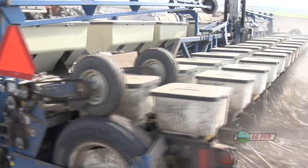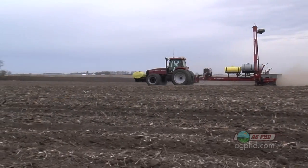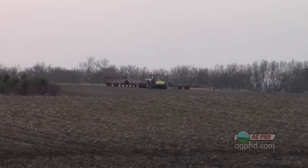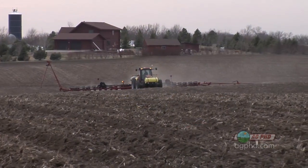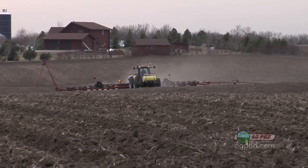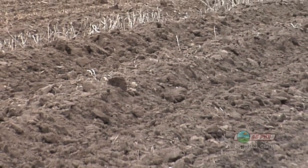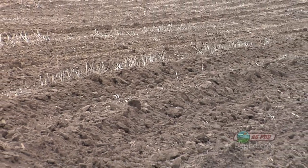Why is that our range? On the deep side, if you start getting deeper than two and a half inches, it's pretty cool when corn is being planted in the United States. We're out there fairly early in the spring, and when you've got seed that's going to sit in the ground for a few weeks, you don't want it too deep. The soil is colder down deeper, and you leave a big window where you could get a crust on top of the soil surface and that corn can't get out and emerge evenly with the other seeds in the field.